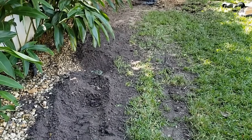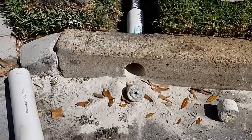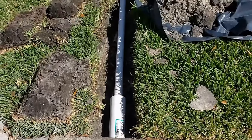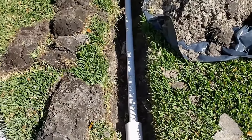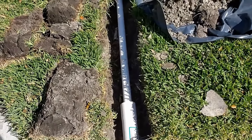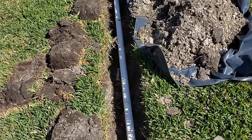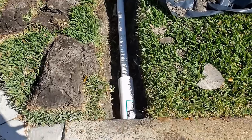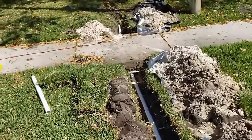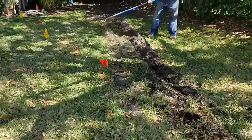The adapter is only about five bucks but hard to find — give me a call and I can help you get one. Our line is coming through the curb beautifully; we're getting ready to cover it all up. Derrick is doing the final backfill up here and the guys are in the back cleaning that section up. The catch basins are in place and set a little bit lower than grade so water drops right in. When we finish we'll pull the gravel back over just to give it the top look and take a little bit more soil away.